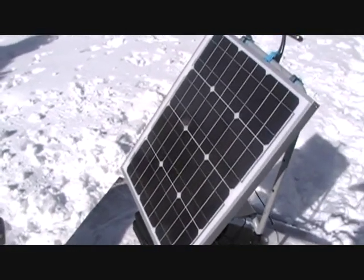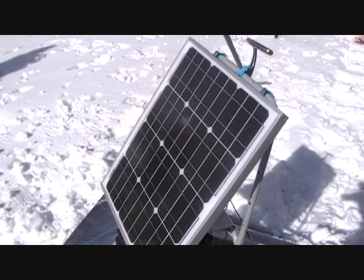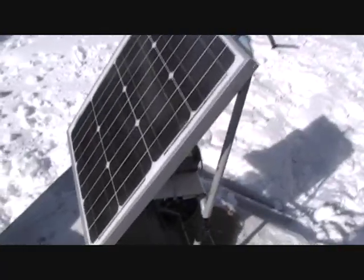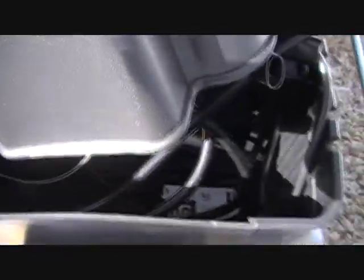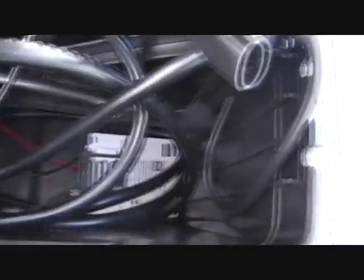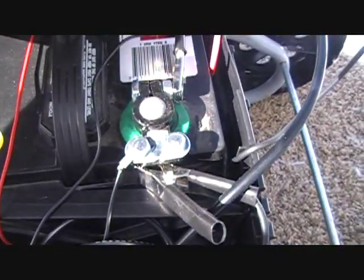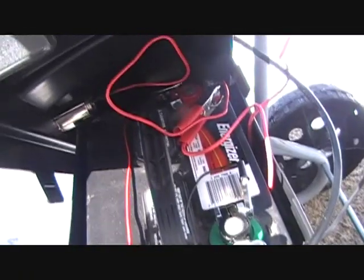This is just set up in the backyard. What I have here is a 36-watt solar panel putting out 36 watts at about 20–21 volts, so it's pretty hot on the voltage. Down here I have it running to a car battery box — there's the old car battery, just a standard Energizer. Down in the bottom of the box I've got a little charge controller I picked up from Interstate Battery for about forty dollars. It's up to 10 amps, so it's pretty good. This little solar panel is only putting out 1.5 amps, so it's well within the limits.